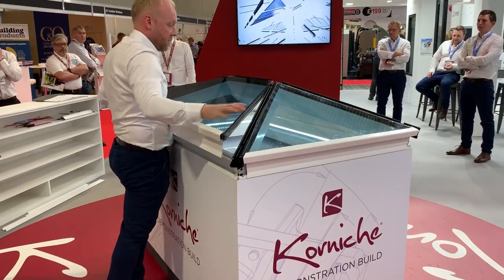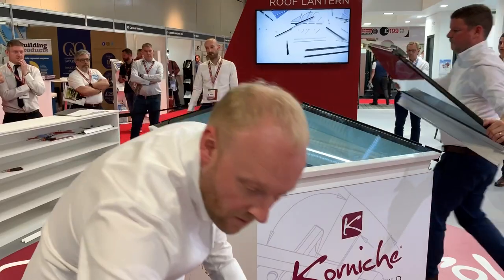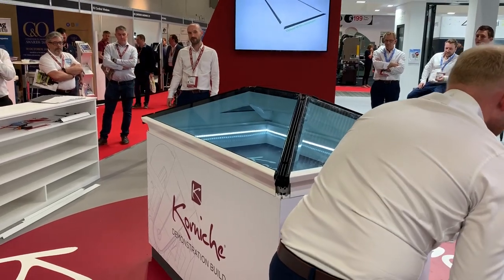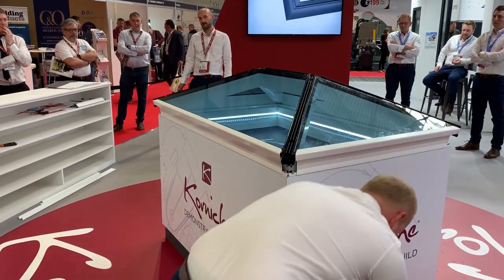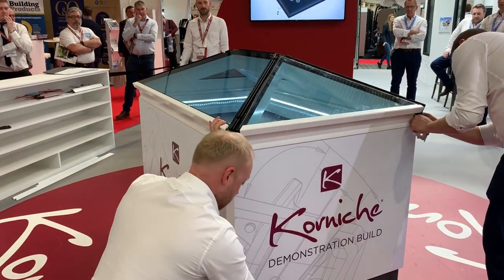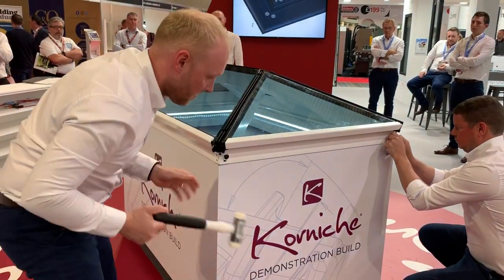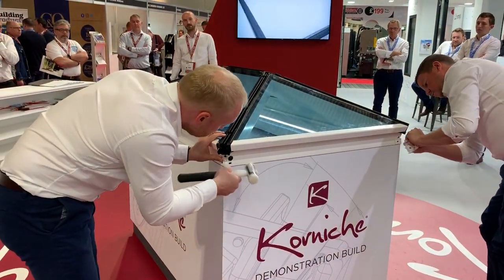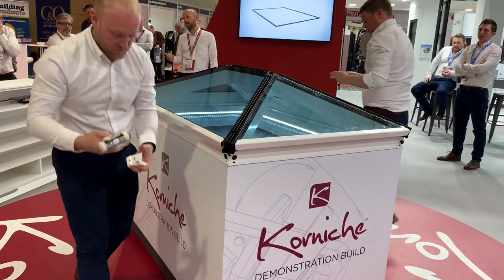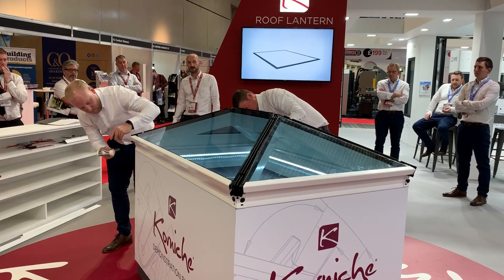You can see how these aspects of the roof really accelerate installation. On our largest roofs — up to six by four metres with eight panes across — you'd spend an awful lot of time glazing with a conventional system, whereas with this system it takes just 10 to 15 minutes to fit and drop the glass in. Once the glazing retainers are in, an end cap is fitted. These little cast caps hold the glazing retainers down, secured by a push-fit firtree clip — a one-hit fastener that pushes in and won't pull back out. To eventually deglaze the roof and change a unit, you'd have to cut the clip off.